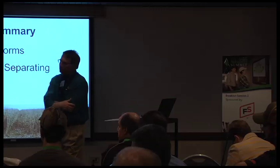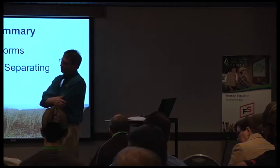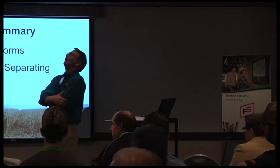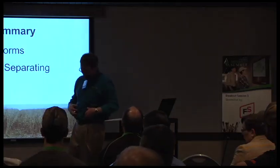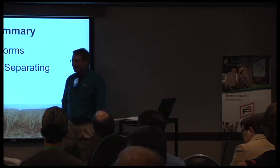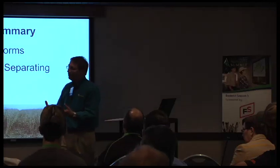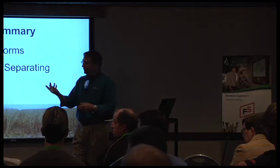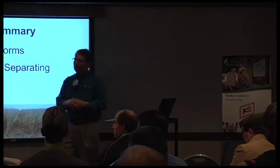On filler plates with a newer red machine — they made the feeder house wider and the space between the tire and frame on the right side is almost zero, so you almost have to remove the main drive tires to get in there. I have trouble with my 2388 getting in there as it is. What I've tried to go through here are huge adjustments that have a really good return on the time spent to do them — even if the access is challenging.